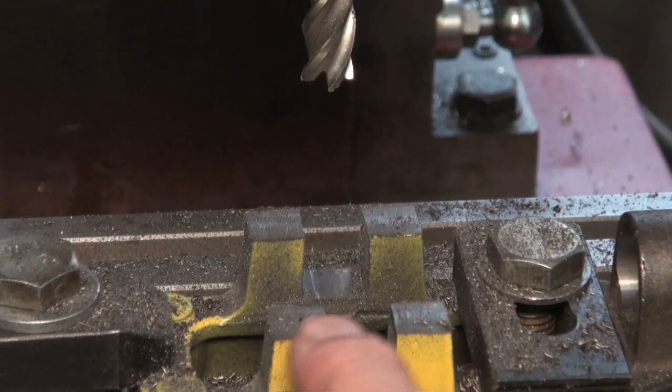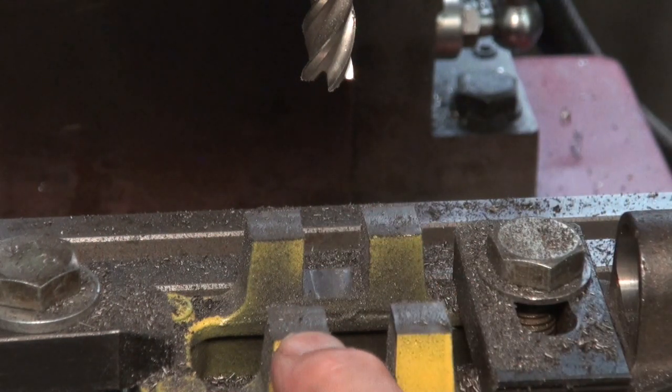I can machine the bearing brasses to fit the slot. It'd be a lot easier than trying to make the slot fit the bearing brasses. So if we struggle a bit, I can compensate that way.